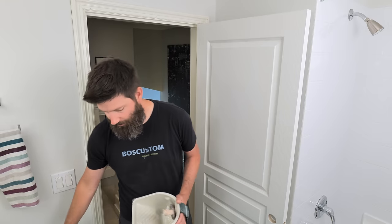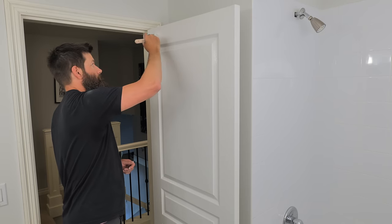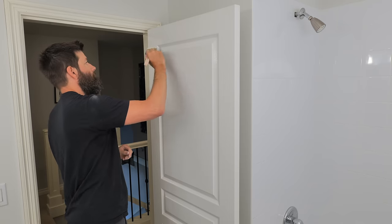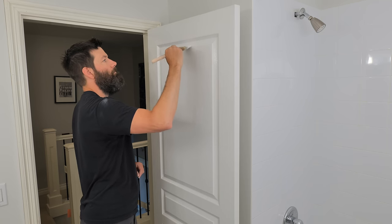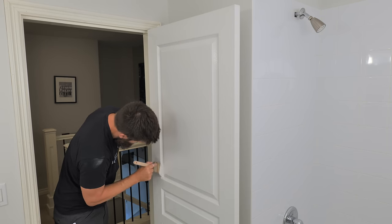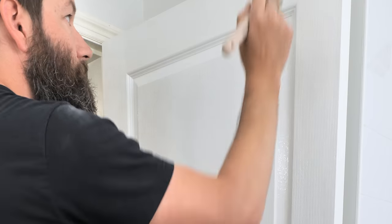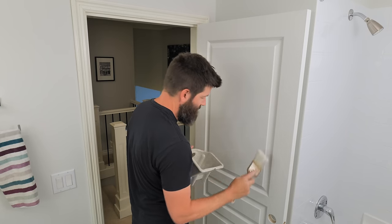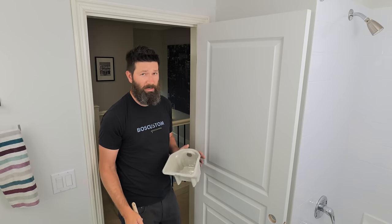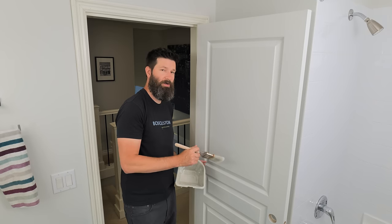Because this door is textured, once all the paint is on, brush out the entire door. Start at the top and follow the different wood grain directions — there are a lot of direction changes, so follow each with nice even light pressure. Work into the reveals, brush out the middle section, and leave the two side rails for last since they run continuously. Before flipping to the other side, do a visual inspection — take out any runs and fade them back into your brushed work, then take out the shim and paint the other side.